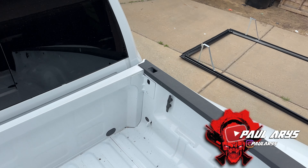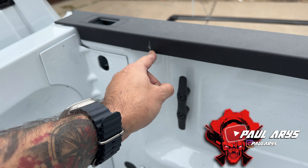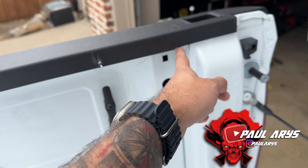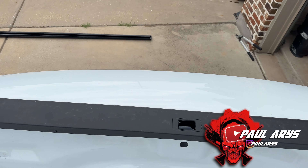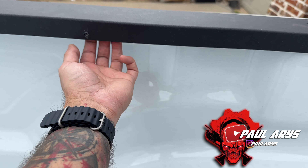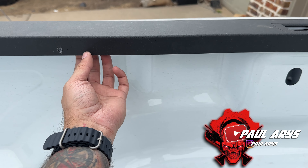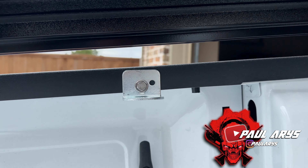Next step — and this is the part I like the least — you take six inches from one border and drill a hole there, then take six inches from the other border and drill a hole there as well. Normally you'd put it in the middle, but unfortunately there's a lot of stuff on the back so I put it roughly where there were no obstructions — roughly in the middle as a support bracket. Same on the other side.